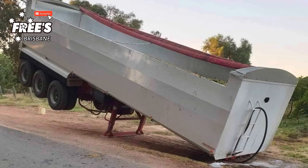Check this one out — a tipper, same thing. If you've been hauling lime, or gypsum, or anything that'll stick in the body, make sure it's completely empty before you unhook, because it'll get stuck up around the well, and then unhook it, and bang. It's quite disconcerting to see an entire semi-trailer sitting on its nose, supported by its legs with the wheels up in the air.